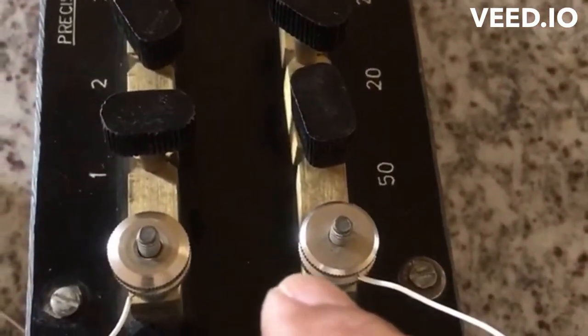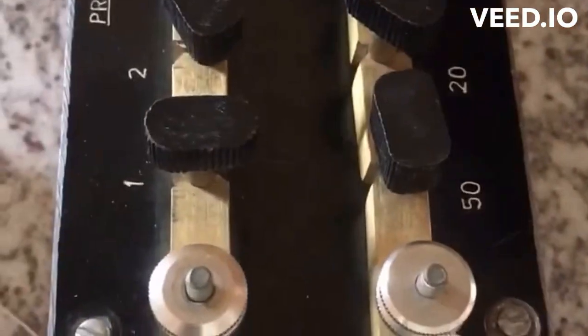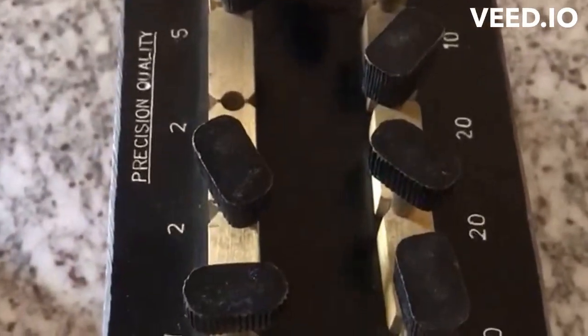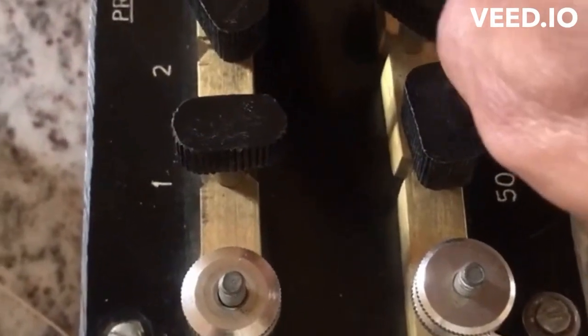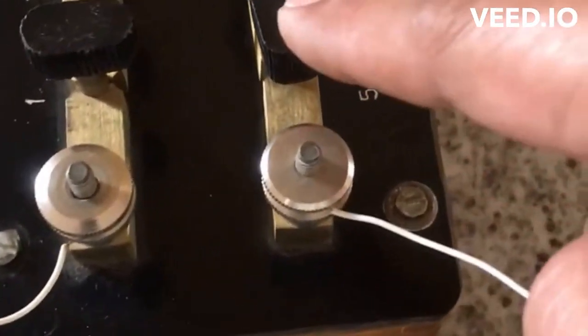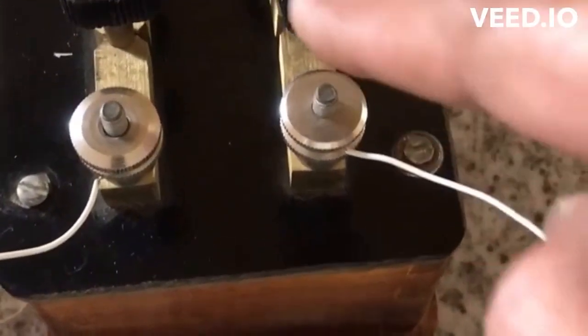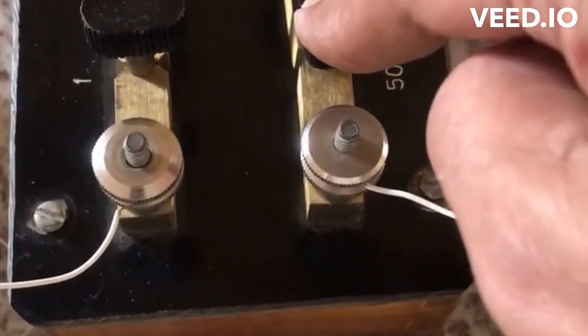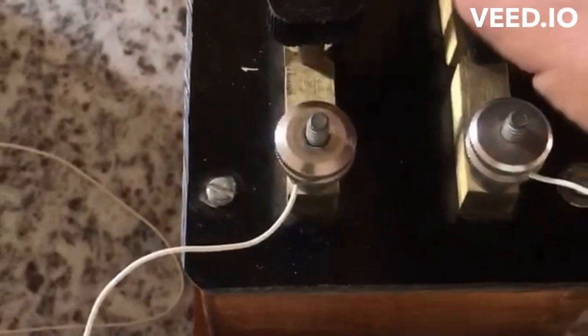Whenever you use a resistance box, be very careful with these plug keys here, because you have to key them in as tight as possible. As you observe, when you remove these keys, that much value of resistance is introduced in the circuit. Here I have removed 2, so that 2 ohms value is introduced in the circuit. Now if you leave any of these loose, then that much amount gets added, even though the key is here. So instead of 2, you will end up adding 52 and you may not get deflection on either side. So here I have kept 2 here.